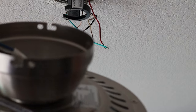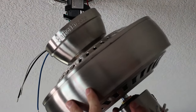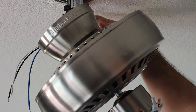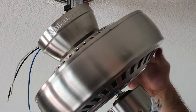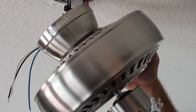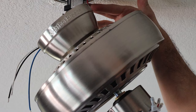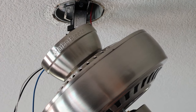Now I've got my fan with the canopy connected to it and our wires are running through. I'm ready to do my final installation of this portion — I'm going to hang my fan on the nice little hook so that I have both my hands free to connect our wires. We're basically going to be connecting like colors. Our black wire is going to be the hot wire for the fan, so we connect black to black — the black from the fan and the black coming out of our ceiling. Blue and red are going to be the hot wires for the light, so those two will connect. Then we have our white wire, which is our neutral, and our green wire is our ground — we need to make sure the green wire is connected to the copper coming out of the ceiling. We're going to get those all connected, have our wire caps screwed onto them, and then cover that with electrical tape.